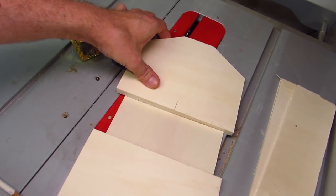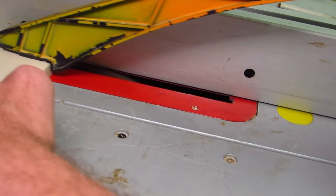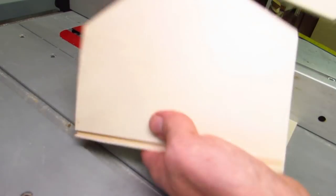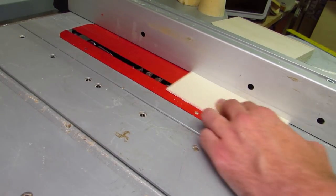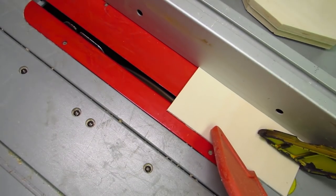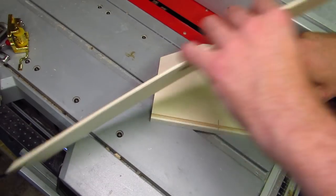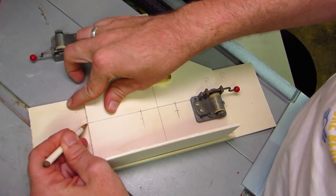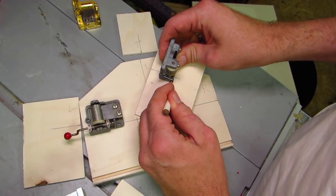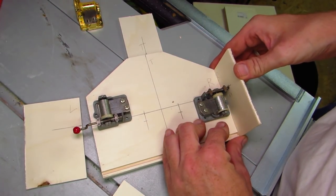For the bottom, I want to slot a piece in, so I cut a slot at the bottom of both sides. To trim the piece to go in there, I first try to deduce the material I need to remove by arranging the sides along the saw plate, but eventually I take a wild guess and cut away more as needed. Then I cut sides and a top to size, mark out the slots needed for the cranks, and cut them out on the bandsaw — though a fretsaw or scrollsaw would have worked just as well.